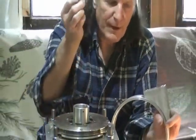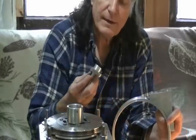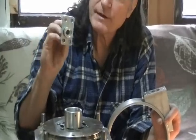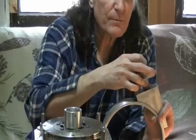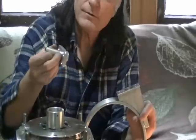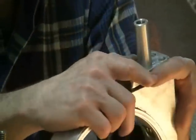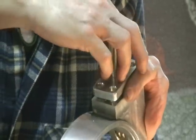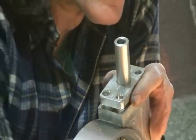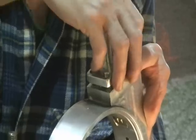Put another 1/8 inch O-ring on the backside. Then we have a slightly modified inlet which has the center cut out to match the 3 1/4 inch threaded backside of the brass, so that slips over the brass and pushes up against the O-ring. So we have a squashed O-ring providing the seal. You can seal it with silicone sealer if you want, but I like O-rings.